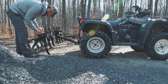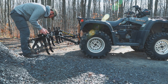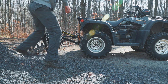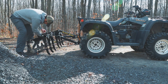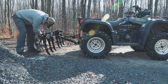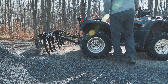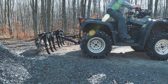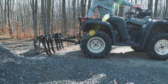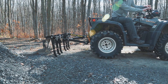I ended up lowering the chisel plow all the way to the bottom. I wasn't very confident at pushing it down all the way because I wasn't too sure how my bike would handle it — it is pretty heavy and pretty strong. The more you push down, it changes the angle of the chisel plow. You can see how they're sort of pointing up still and not getting a good bite onto the ground — it's just sort of skimming the top.